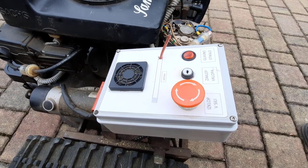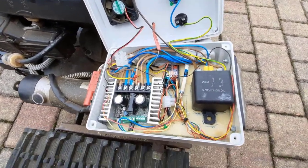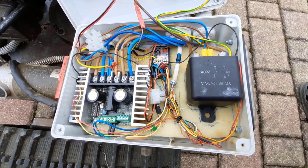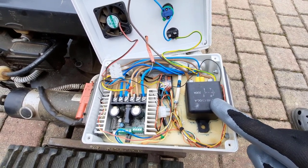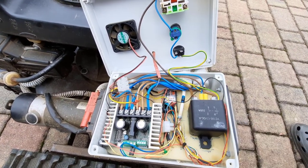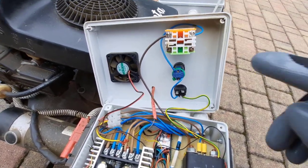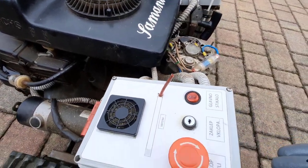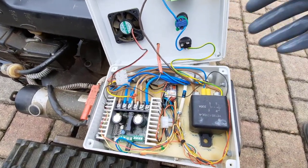Let's open the first electronic box. I need some sort of cable management system, but let's focus on the parts here. We have a high current relay to power on and off the main supply, a remote control receiver, and a Sabertooth motor controller. This relay is connected with three switches, so any one of those three switches can shut off the main power supply.